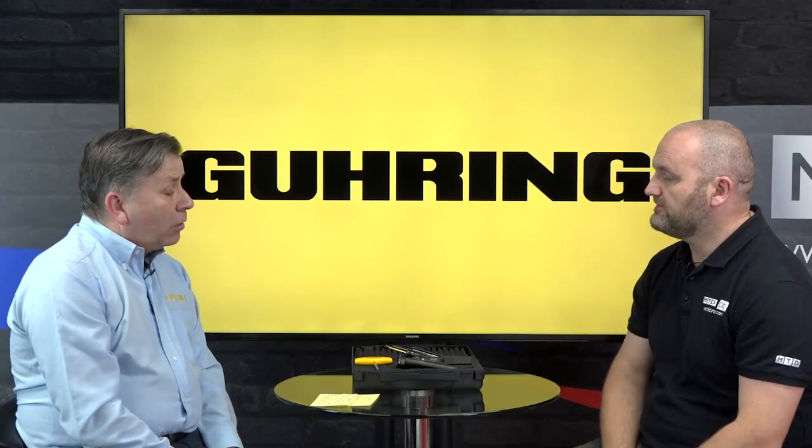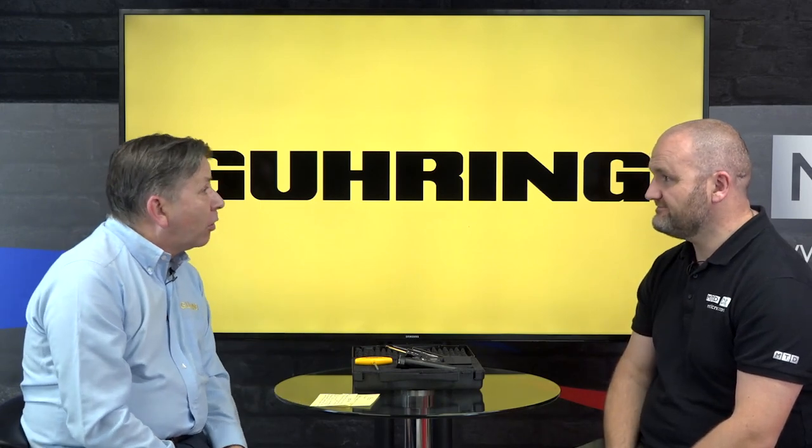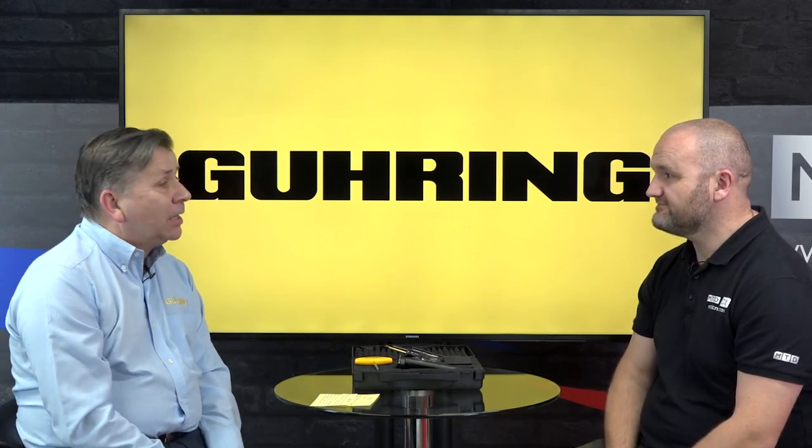One thing that's fairly unique to you guys is the wiper, isn't it? Absolutely. Tell the viewers about your wiper. Well, the wiper insert we introduced back in 2016 with the 104 and the 106 series, so we've had it a while. As you rightly said, we believe it's quite unique. Wipers have mainly been used for getting very good surface finishes on parts, or you can wind the feed rate up so you get more productivity and the same sort of surface finish.